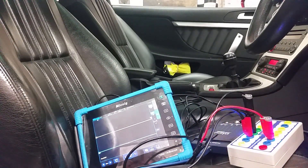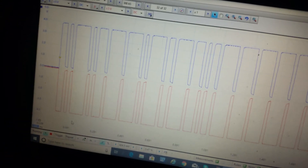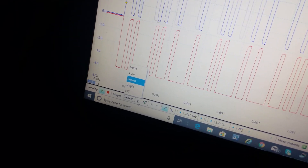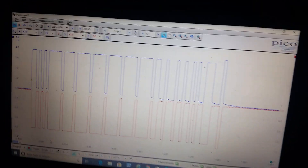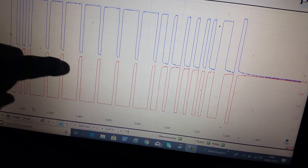So she's up and around. We're collecting it into the Pico. I'll just get rid of the glare for you guys. There's a wee light show there - that's what she's like on the Pico. We'll have it at 200 milliseconds per division, 300 kilosamples capture, but I have the trigger on repeat, which is a handy feature of this Pico. So we'll change that to a single, which will just get me a screenshot of it.